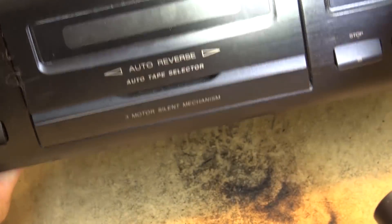Let's do a test recording. I have a track queued up. Let's go past the leader at the beginning of the tape. I've got Dolby B noise reduction on. We'll start playing right now, let the whole track record, then rewind the tape and play it back to see how it sounds. I did a recording in both directions so we tested the auto-reverse as well.